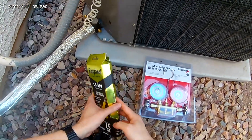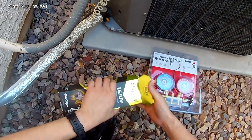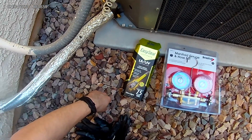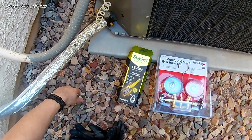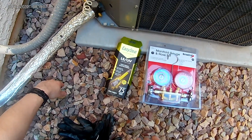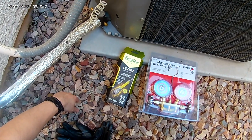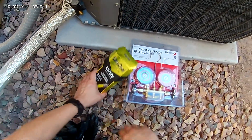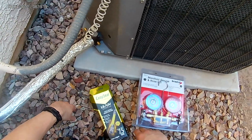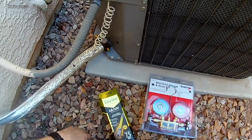Today I'm going to try to reseal the AC. The air conditioner is running but there is no cold air in the house. The return is like 78 but the vents around the house are 73, so the temperature difference is not too high. I talked with the HVAC guy and he told me I need a new unit for like $13,000 — the AC and the air handler, the whole combo is $13,000.